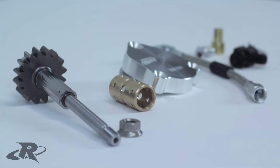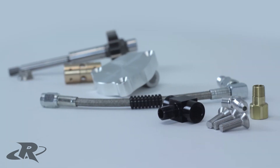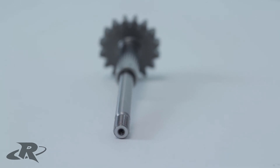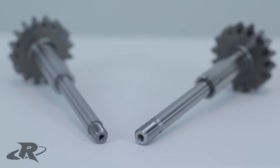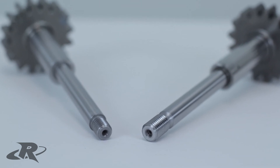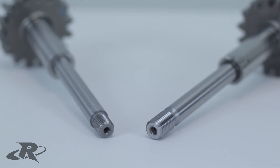The through-shaft oil system and one-piece bearing design are features only found on the Riva Gen 3 shaft kit, making it superior to the competition. Another feature of the Gen 3 shaft is the larger diameter threads and nuts on the impeller end of the shaft. On the left is the OEM shaft — the smaller diameter can be another common failure point as it can shear under high RPM and boost pressure. On the right is the Gen 3 shaft, where the larger diameter threaded area provides improved strength, helping to reduce this type of failure.